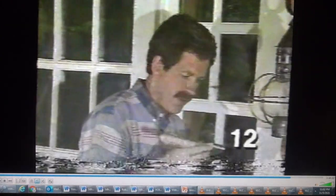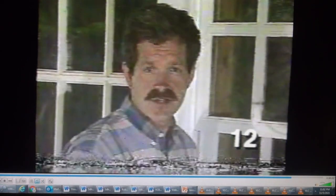I'm using an oil-based enamel, which will give us a smoother finish than a latex. And I'm working with a trim brush here to put our first bit of paint on the casing. I'm starting to cut in along here underneath the log. This is difficult, but you do want to go nice and slow. If I get paint on the logs, that's going to be difficult to clean off. In fact, I'm sure Joelle will probably have the blinds done before I'm half done here.